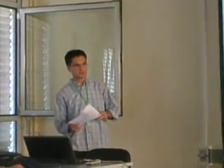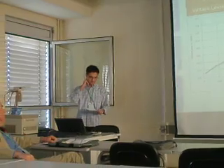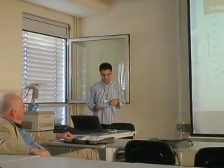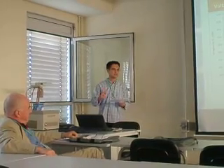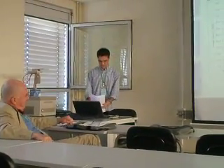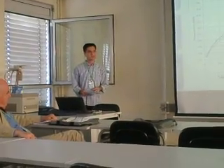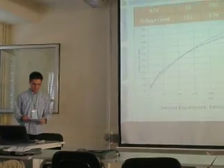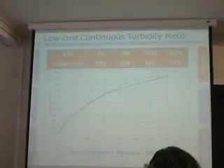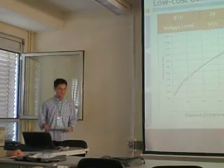This is the first result. It shows linear behavior, but the resolution achieved is approximately 1000 NTU, which is extremely low. So we decided to improve the device by optimizing the distance between the emitter and the detector. With the new setup, we obtained a curve which can be approximated by a second-degree polynomial, with a resolution of approximately 34 NTU. This is an improvement, but still cannot be considered very good. One remaining problem is that for values near zero NTU, we are seeing almost half the voltage scale offset, which indicates a very significant noise level.